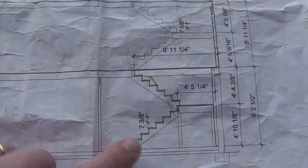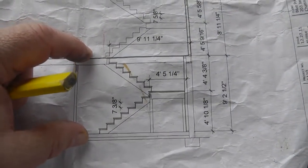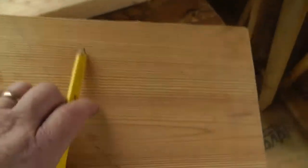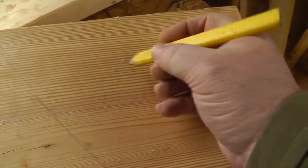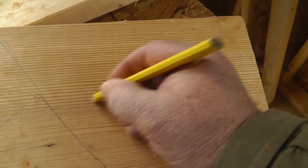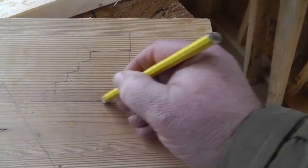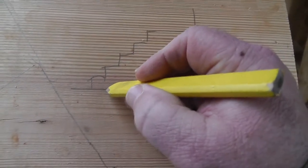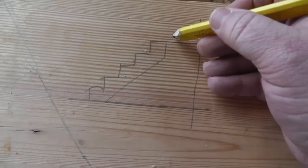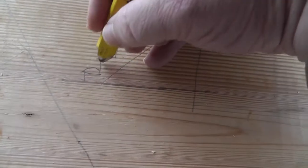The most important thing to remember about stairs is to plan them out ahead of time, where you've got the total rise and run already established, and you do a drawing just like this, or you can even sketch it out. Even if you just do a simple drawing by hand, where you visually show all your stairs and your landing. And you just go ahead and draw in your 2 by 12 to visually show yourself what you're doing. You take the rise divided by the number of risers, and then you subtract all the trim, like the treads.